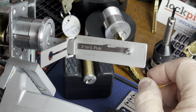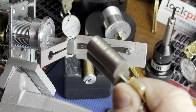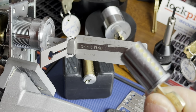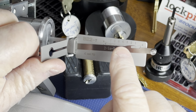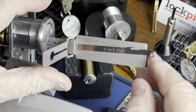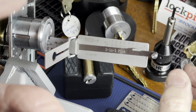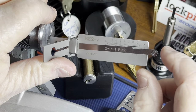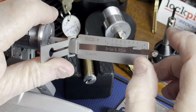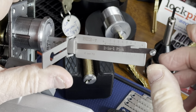You know, each cylinder's unique, but I've got many of these cylinders and I pinned them up, and here's just 2 of them. And I'm gonna show you how fast and easy it is to pick through a cylinder if you start on the Best cylinders anyway, all the way at the 1. And you put a humongous amount of pressure to the point of your thumb getting all sore. Now, I did spend a while doing this, so this is not a fresh pick, but I think you want to see how to do this now with a Lishi